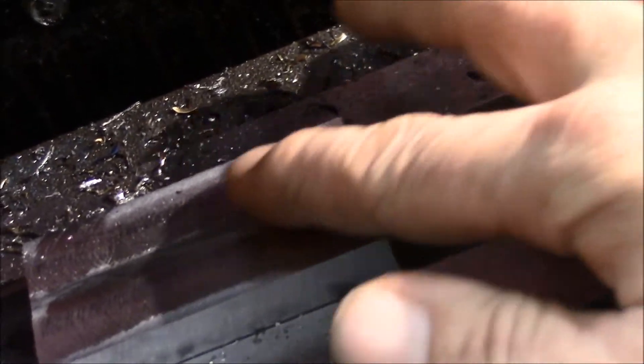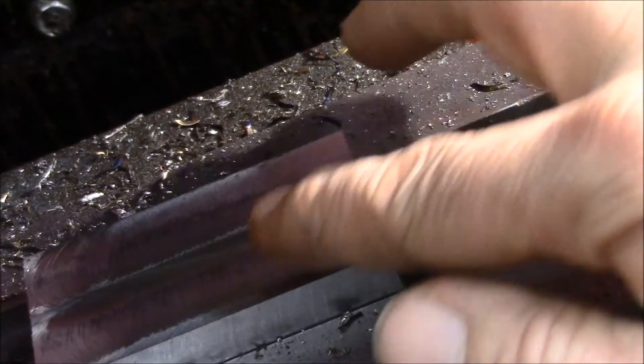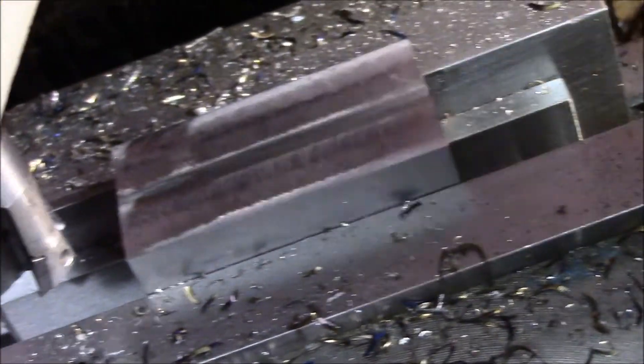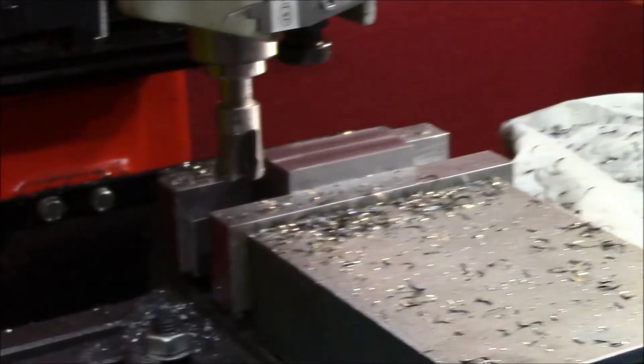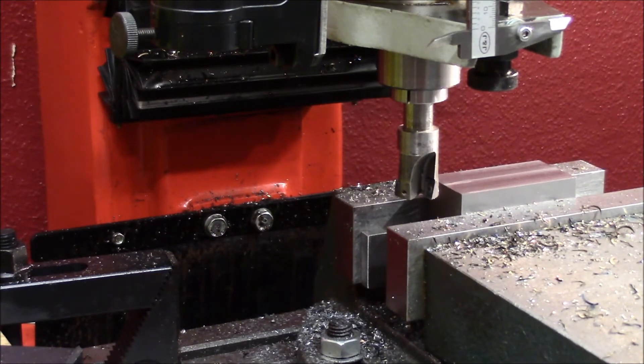And the finish — that was actually what I wanted to show you. That's not bad for a 2mm depth of cut at 8cm per minute feed. If it can just do half of that when I'm actually using it, it will be very much quicker than the fly cutter and end mills and whatever else I've got.